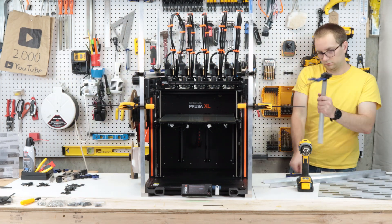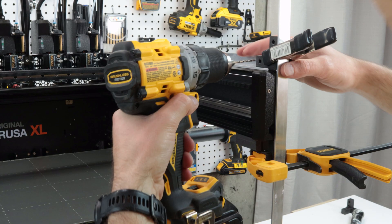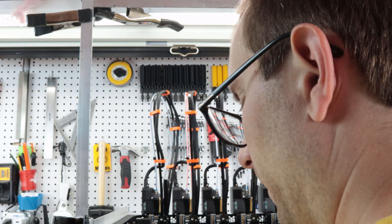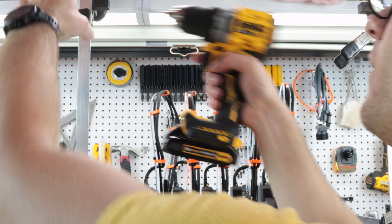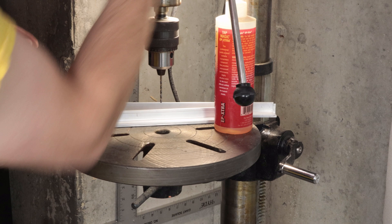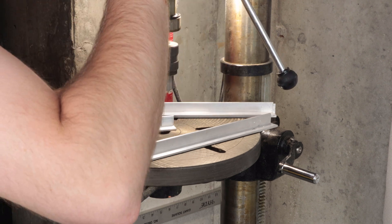I also 3D printed the corner pieces so I could attach them together, again with clamps for now. After everything was assembled and clamped together, I worked around each joint and marked where I needed to drill holes by scoring the surface with a drill bit — either turning it with my fingers or powering it for a few turns just to mark the positions. Once I marked out all the hole locations, I disassembled basically everything and used a center punch so I'd get good, well-centered drilled holes. I drilled a few with a hand drill just to prove it could be done, then used my drill press to speed things up. The process was easy: drill a pilot hole with a small bit, then drill the full-size hole.